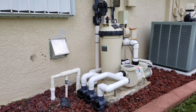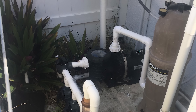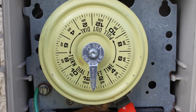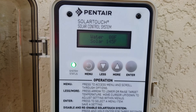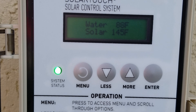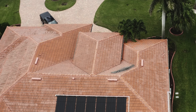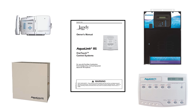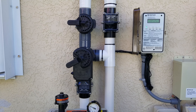Due to the variety of controller and variable speed pump combinations, your solar controller may or may not control your pump. If you have an older single speed pump, your solar controller will not control your pump — your pump timer will be set to run when solar energy is most likely to be present. On this controller, you can check the current solar temperature by pressing the enter button, which will tell you if the solar panels are warm enough to heat your pool. It must be several degrees warmer on the roof than your pool to get effective pool heating. To turn your solar panels off, simply reduce the set point temperature. Solar controllers are the simple way to control and optimize your solar pool heating experience.